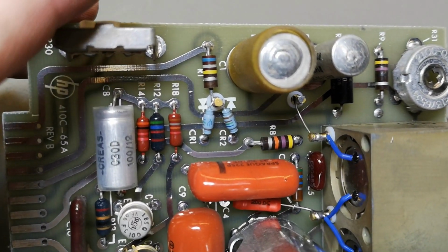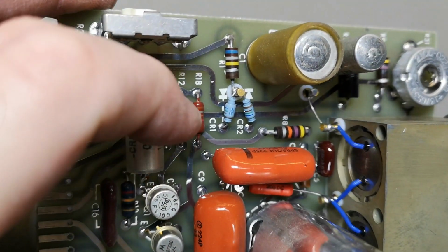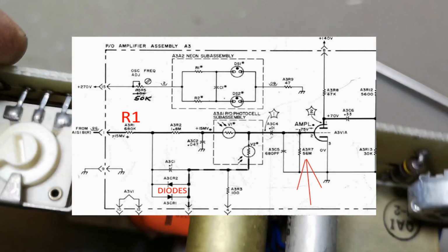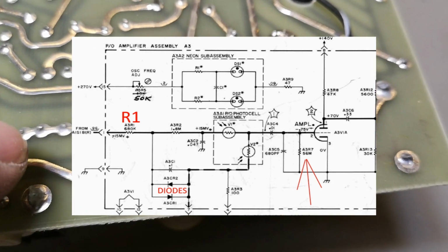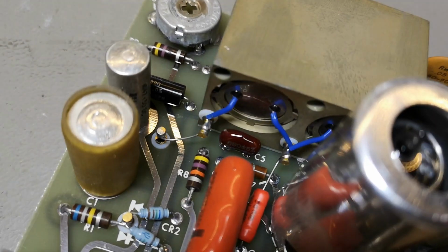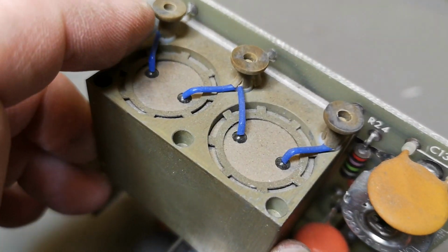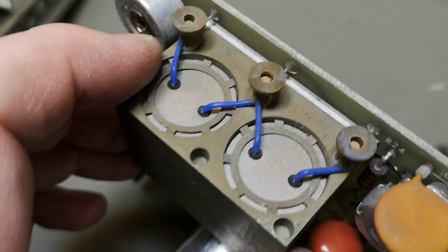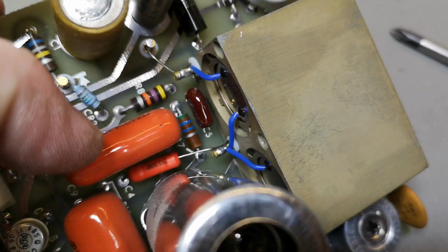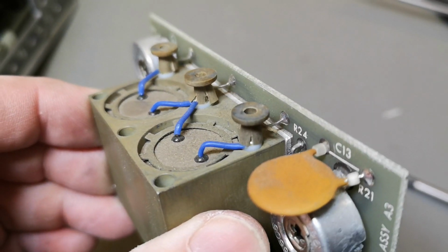Actually a little bit fun to see this and the schematic at the same time. So this is R1 and the 2 diodes for input voltage limitation. See this point here goes to the capacitors, and then it goes into the first photocoupler. Right. So the center point of that one, is it that side or is it that side? I'm a little bit curious about that.